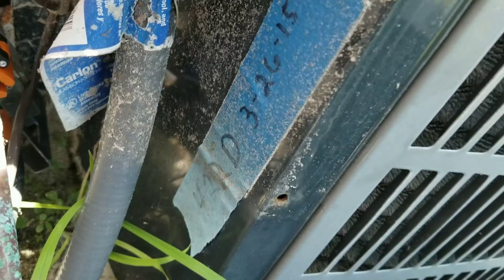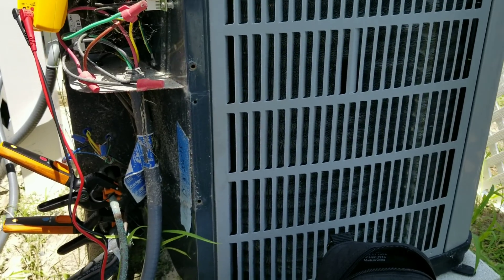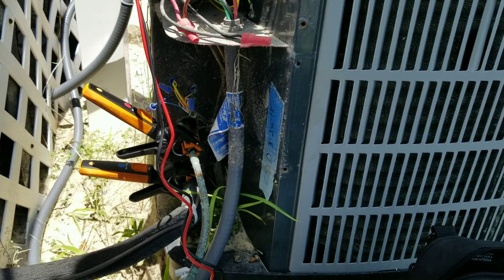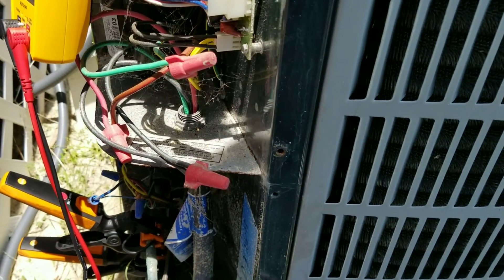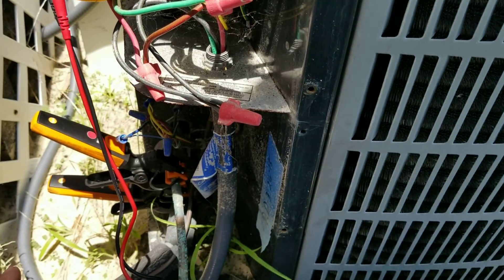All that good stuff, making sure there's no other underlying problems as we usually do. This unit was converted — looks like it's never been here before — it was converted to R-422D back in 2015. So I'm not gauging up on it. When I talk about checking refrigerant charge when we find dual capacitors, it doesn't always mean you have to hook up your gauges. You can use the non-invasive method where you essentially just check line temperatures, do a little bit of math depending on your efficiency, and that'll give you a very accurate idea of what your refrigerant charge is without having to gauge up. Just keep that in mind whenever I'm referring to that — that's what I mean.